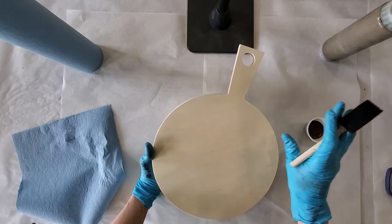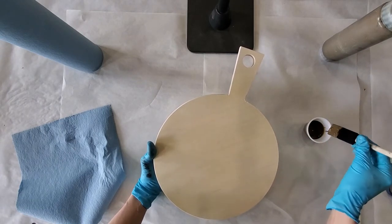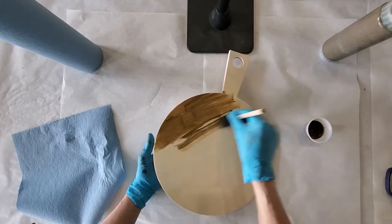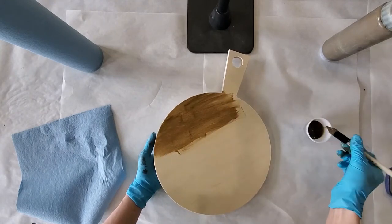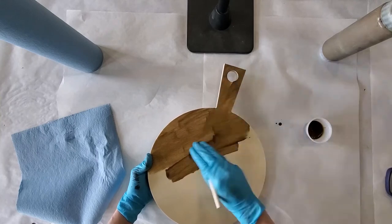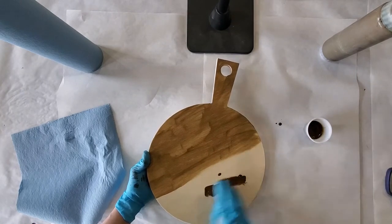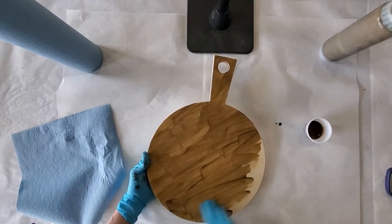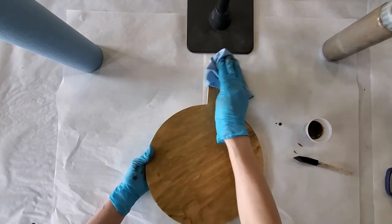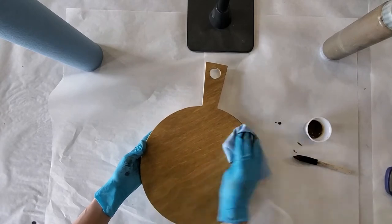You're going to notice that the grain is going a little bit off on an angle, which is fine. Take your foam brush, give it a good dip in the stain, and then I like to turn it on its side so I can wipe it on instead of just letting the brush go flat. This allows for a little bit more consistency and it speeds up the process. Do one side first and then you're going to want to wipe it to blend it. If you just let it dry as is, the spots that are a little heavier will dry that way, and wiping also helps it dry faster because you're removing any extra moisture.